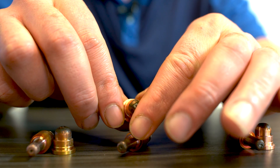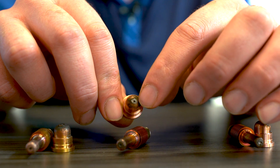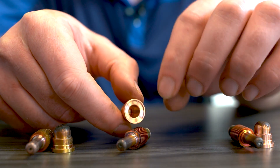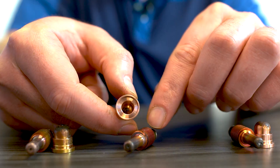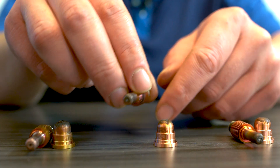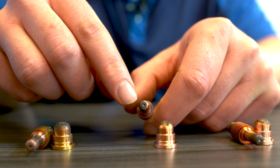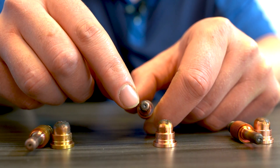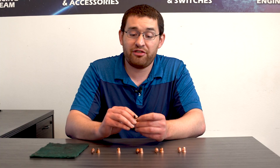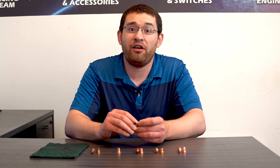Finally, if you do decide to push it a little further, you're going to start seeing some serious wear and tear on your nozzle. The nozzle hole is going to be much wider, and you may even start getting a lot of discoloration as the copper just completely burns off. On the inside, you'll see a lot more discoloration and scoring. I wouldn't use this for any real cuts — maybe a test cut, but this is really not practical for any good results. On your electrode, you'll see a lot more discoloration and scoring on the top. The hole is now becoming more of an actual hole as opposed to just a marker, and you'll start seeing the copper actually flake off because of the heat. Discoloration goes all the way up to the spirals and even up to the tip — you're starting to border on unusable, and some welding or gouging may happen that you don't want on your end results.